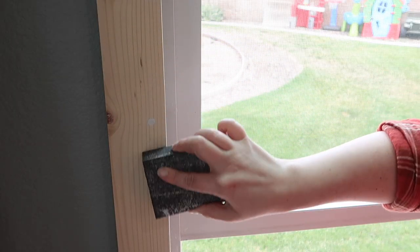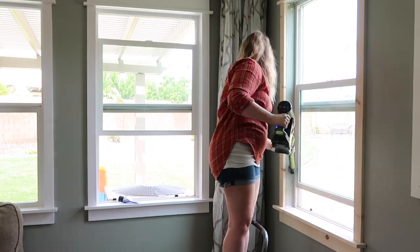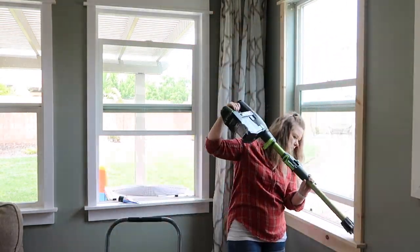The wood filler is dry, so I'm going to go in and sand it. I've been loving using sanding blocks — they just make things like this so easy. You can get into corners. I'm using 60 grit just to knock off the thicker pieces and then I'll go over with a 120 and a 220. I did go through with all the sanding blocks, got it nice and smooth, and then I vacuum and use a cloth to get off any dust.